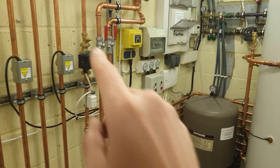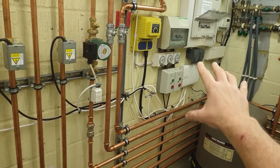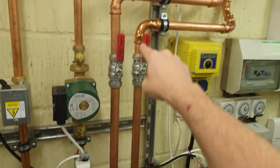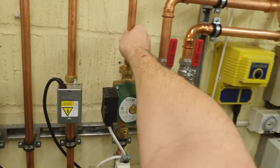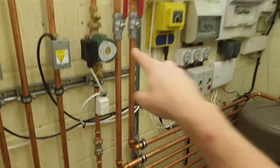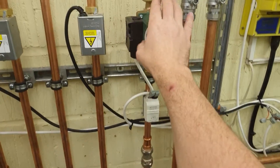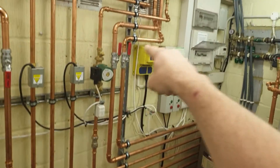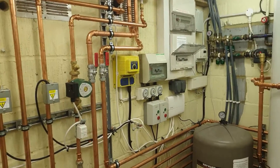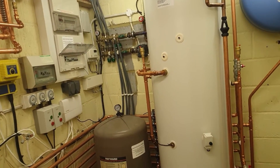The other measure is this pump here — PIR movement sensors are being installed in bathrooms, and when you walk in a bathroom the sensor will activate this pump, timed so hot water is pushed out to the far end of the house. If someone goes into another bathroom it runs for the same duration. There's also a secondary return pipe stat set at about 40 degrees that cuts power to the pump — stopping it from churning up the stratification, wasting heat along the pipe, and using unnecessary electricity.